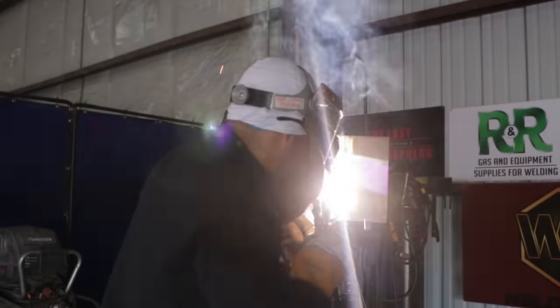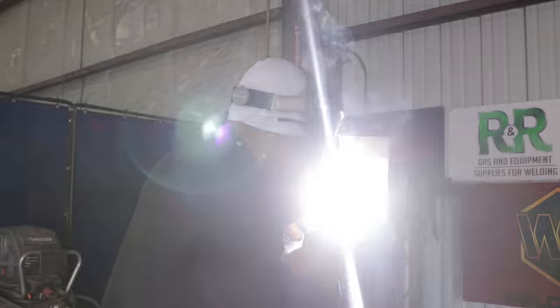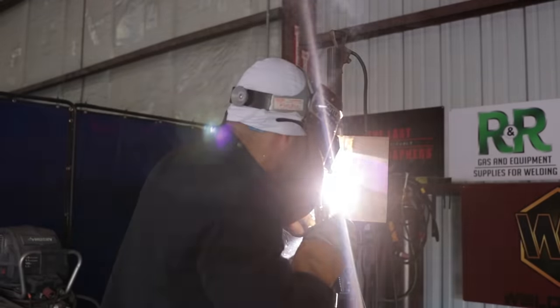what we're going to do, when we sweep across, you want to pause long enough to where that undercut is going to fill up. But now you have to be very careful, because if you pause too long, then it's going to drip on you. So it's going to be a quick sweep to the side. You're going to pause. Maybe about a second, second and a half, right? Sweep across the other side and pause a second or second and a half.